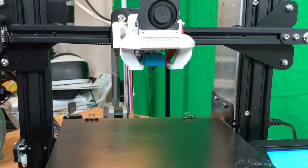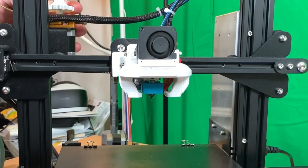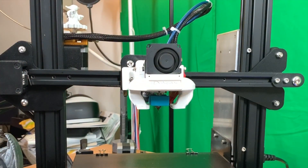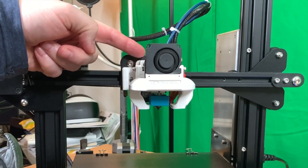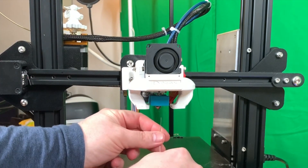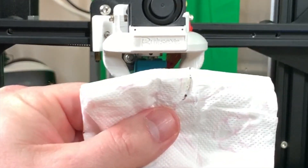You can try to move a little bit of filament through the extruder and see if anything happens. When I'm dialing the knob, I can see that I cannot push any further. You can also see the tube is moving, so I'm not going to over-turn it — I don't want any damage on the filament. I'm putting it a little bit back and then I'm going to use the needle. I leave the setup as it is, move the heat bed back a little, then put the needle inside and wipe in one direction — and as you can see, something is coming out.